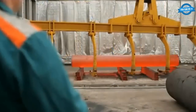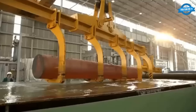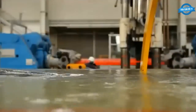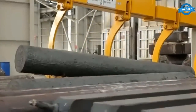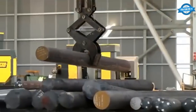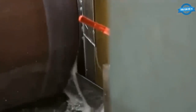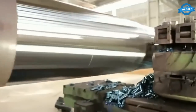The final step in the manufacturing process is cold drawing, which involves pulling the steel bars through a series of dies to reduce their diameter and improve their surface finish. This process is carried out at room temperature and results in a smooth, polished surface that is free from defects. Once the steel bars have been produced, they undergo strict quality control checks to ensure compliance with international standards. ASO Forge has a dedicated quality control team that uses advanced testing equipment to check the chemical composition, mechanical properties, and other characteristics of the steel bars. The company also provides test certificates with each order to provide customers with complete traceability and assurance of quality.